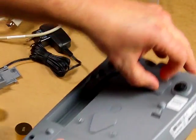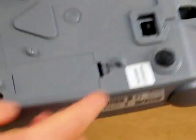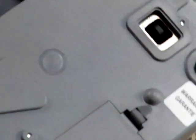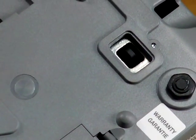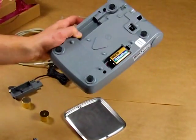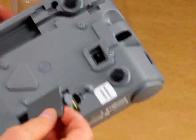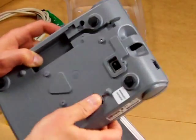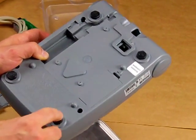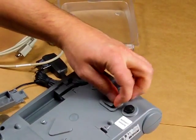The balance also features an underhook on the bottom for specific gravity weighing — a nice feature not found on many scales in this price category. The balance is powered on standard 9-volt batteries, so there's no need to buy a rechargeable battery pack. It has four feet, but these feet are fixed and do not level. More expensive balances would have adjustable feet, so you need a level surface to place this balance on.